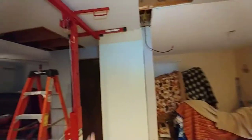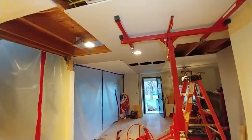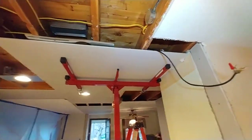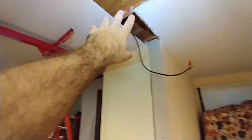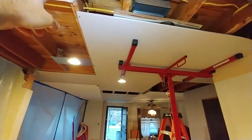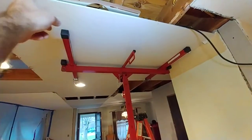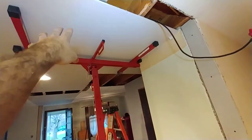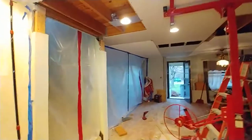There are just a lot of concessions and thinking to do. We've gotten to this point, which I'm really happy with, but I wanted to show you — it seems so easy, you just put some drywall pieces up there, and when you see them up all done it looks like it didn't take five minutes. But I have to go up in the hoist and start committing to certain elevations, and I can see here I had a quarter inch on this side, so I'm going to carry a quarter-inch slip of material and slide them in underneath the board. I've also got to be able to screw the board down in areas where I can't pierce through that sheet metal easily.